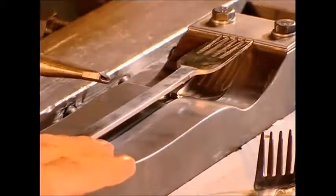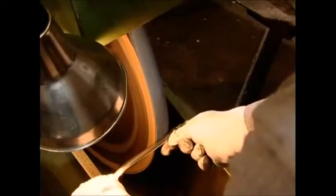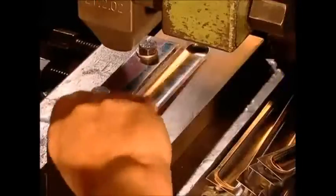If you're making luxury dinnerware you also have to make sure you wash the press before you can actually do any bending. Any dirt would mark the metal and the fork would have to be thrown out. The freshly bent cutlery is then sent off for a quick polish to remove all the sharp edges. The worker will also grind down the surfaces so there aren't any unwanted fork-related injuries.